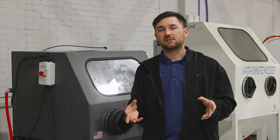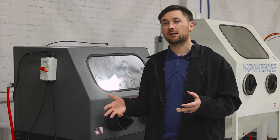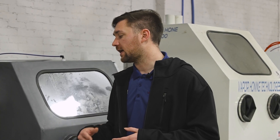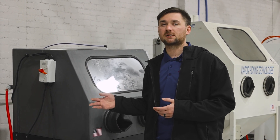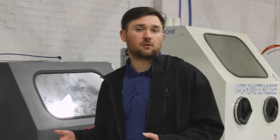Those would be your advantages of the closed loop system. A couple of disadvantages are that it is a higher upfront cost — these closed loop systems can range anywhere from $650 to $1,000, so it will increase the price of your machine by that amount. The other thing is that it does require a little bit more maintenance, because if you're blasting dirty parts, you're continuously recycling that water back into your system, which makes for a little bit more maintenance compared to an open loop system since the water gets contaminated easier.